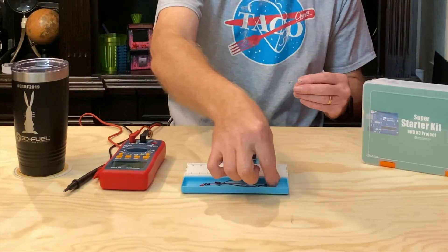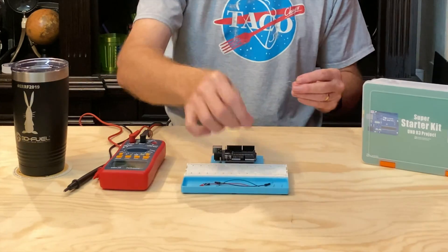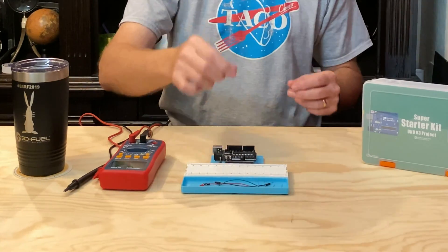There are 10 different resistor values included in the kit, and they're probably the most common ones. If you want, you can organize the resistors into tiny parts bins. When you build a project, you can get the values that you need from your bins, and when you take a project apart, you can measure the resistors with a multimeter and put them back in the right bin. But I digress — we need a 220 ohm resistor, a 1k ohm resistor, and a 10k ohm resistor.